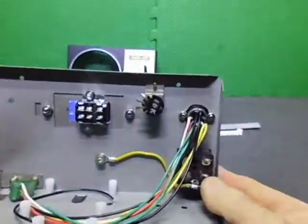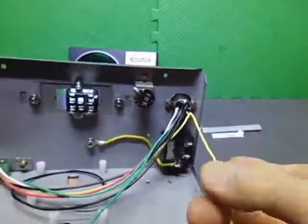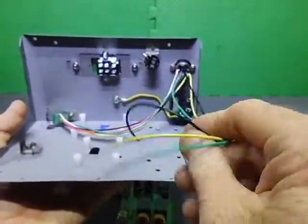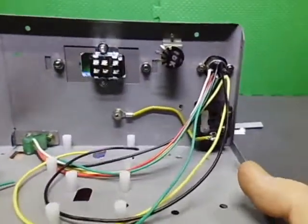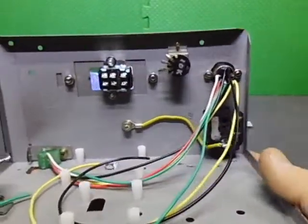So basically this wiring is for the remote. This is where the direction switches go off these 3 wires. So you feed 0 volts in, and it then controls the relay. The switches do not have any current on them. The relays are all taking care of the current and everything.